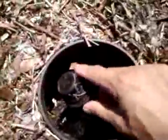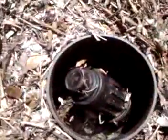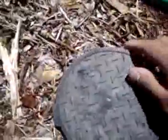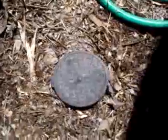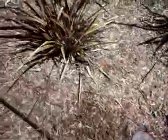out into these, again, filters, Y filters, and pressure regulators, which drop the pressure to 20 psi and clean out any deposits or sediments in the water so it doesn't clog the emitters. Then it goes into the poly tubing, which I showed over there, with a 1/2 inch connector. So that's that line using a dripper line.